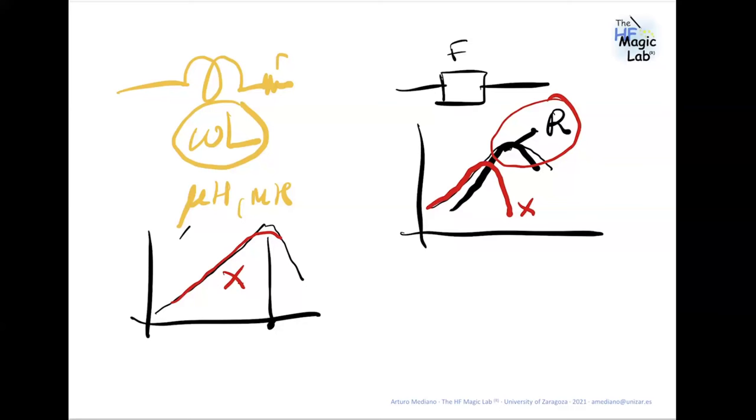In the case of an AC-DC converter, when the heat sink needs to connect somewhere to avoid EMI, where should it be connected? Considering that the heat sink is working with power devices, the general answer would be to the power ground. So the activity that you are injecting from the device to the heat sink is returned to the ground of the power system. But obviously, you can have some problems, for example with safety or with immunity tests, and then you need to apply other solutions. But the idea is to put the heat sink at a constant voltage, so it's not floating and not experiencing dv/dt.